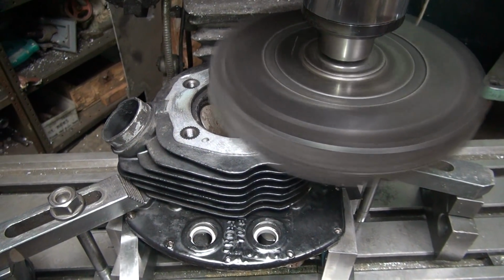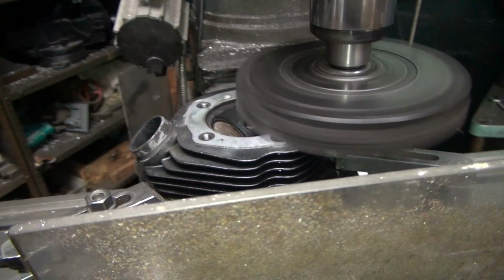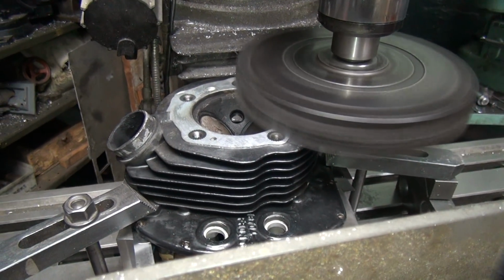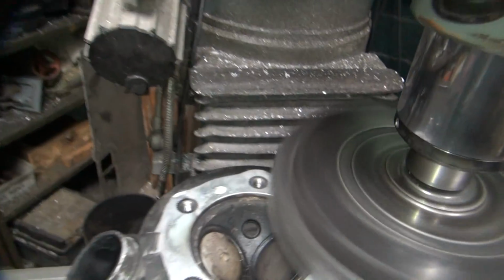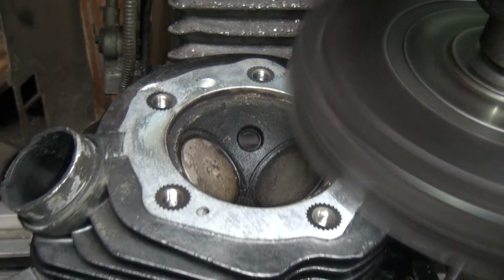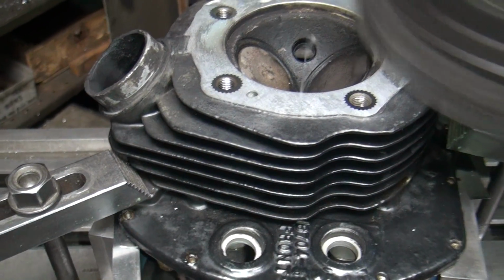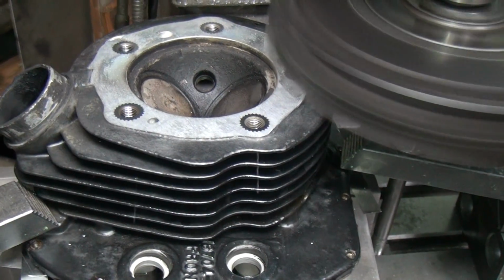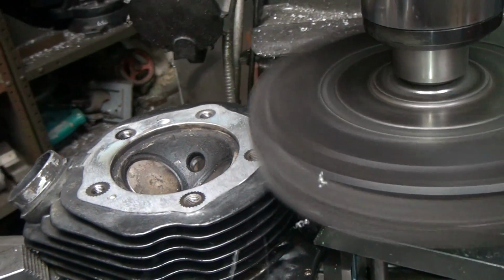Appears to have a lot of low spots in now. I noticed when I was pulling the feeler gauge, I was hitting spots in there. Oh, hear that steel hitting? No, we're hitting heavy. We're hitting right on the back right there, see? Your head appears to be uneven. There's something we never corrected before.